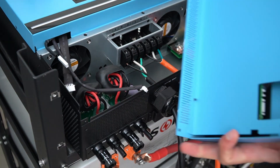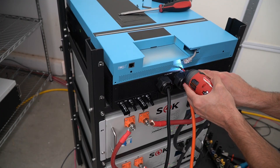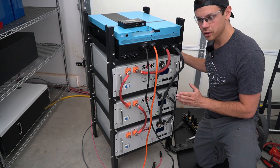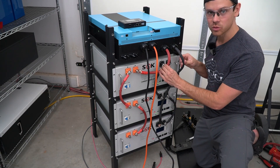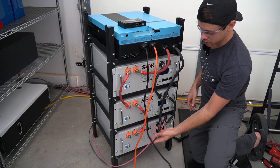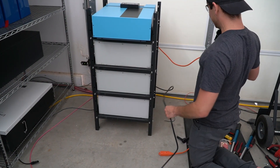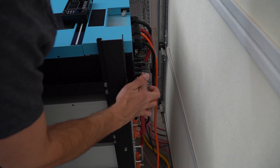Now all the connections are made and we need to connect this display unit to these cables right here. I don't think it gets easier than this — I just built a massive system in less than an hour. The last step is rotating this towards the wall. Whatever wall you mount it towards, you should put hardy board or cement board on that side just in case something happens or one of these wires gets really hot — you want a non-combustible material there. Then we just hook up the solar and it should fire right up. How clean is that? That's beautiful. So simple — anybody can do it.